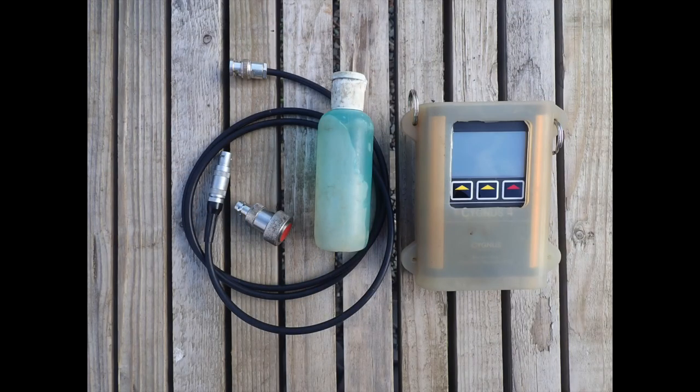Getting equipped for ultrasonic measurement of metal hulls requires a fairly substantial investment. There are broadly speaking two main choices of ultrasonic thickness meters for the aspiring steel surveyor: the Cygnus range or the Tritex range. I've been using my Cygnus 4 general purpose meter since 2013 and have found it to be an excellent piece of kit. Its only real limitation for me has been reading the LCD display in bright sunlight. It gives consistent readings, sits easily in my left hand leaving my right hand free to take the readings, and has a signal strength or confidence scale on the left which lets you know when you have a good reading. From what I've seen of the Tritex thickness meters, they offer a similar capability to the Cygnus in a slightly different package and are an equally popular choice among small steel craft surveyors. It comes down to personal preference and whatever price deal you can get, including servicing and extra probe heads if you need them.